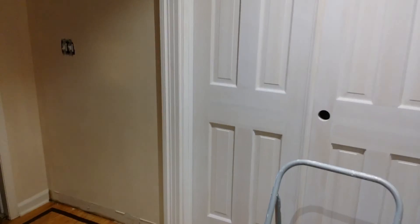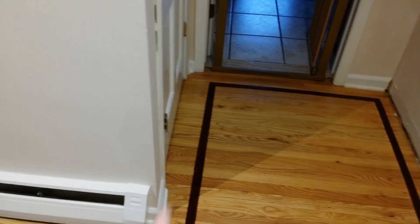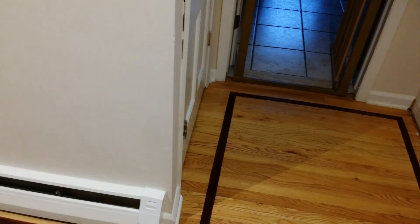This wall here was never really prepped — it was sanded and just quickly skimmed out. And then I have issues. This is an old transition door. The inlay was done squarely, that is square, but as you can see the wall is not. So I have to build that out.